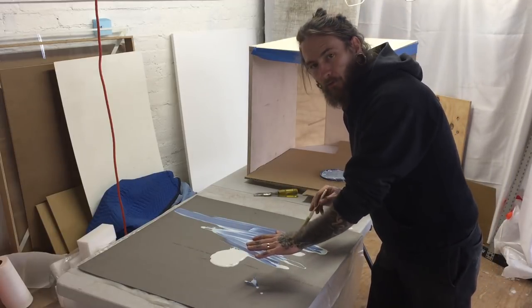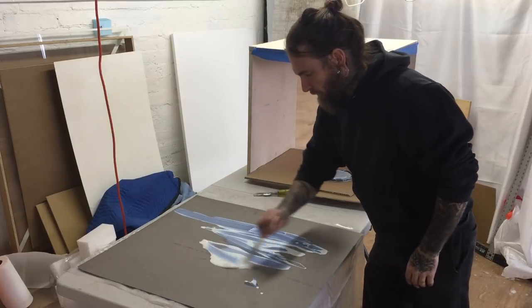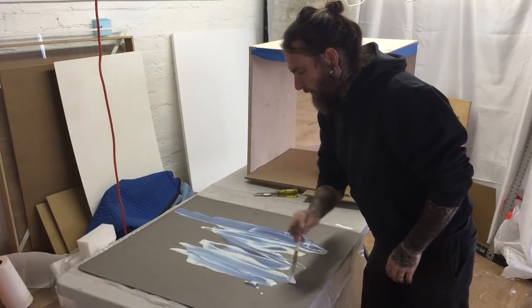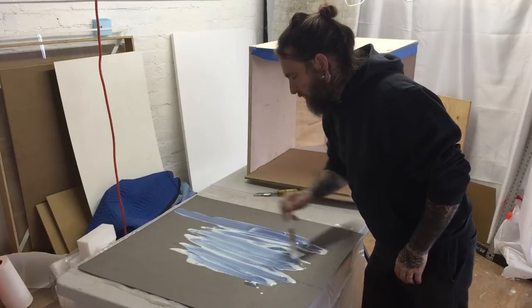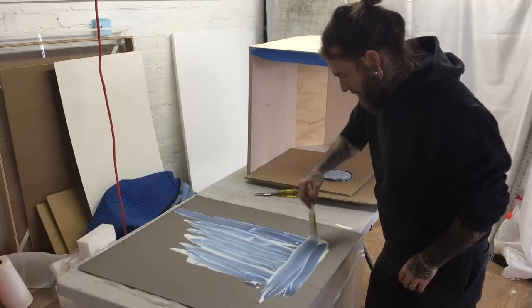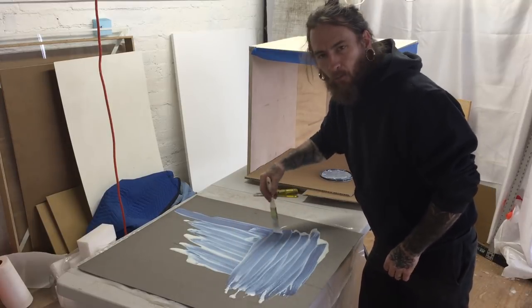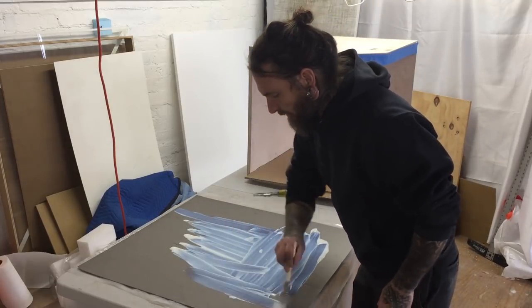So this is the back of the Formica. And then we're going to go ahead and coat this with the contact cement as well, the surface we're adhering it to. And then once both sides are kind of dull looking, you put them together and roll them so you can get the pressure on, and then add weight to it. We're just going to pile stuff up on it.